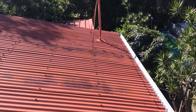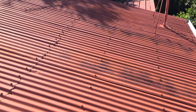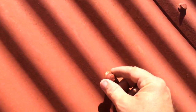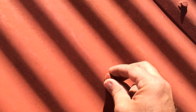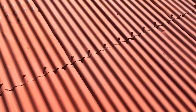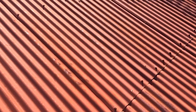I'm up on this iron roof today and it's got the old-fashioned lead head nails. The lead heads on them actually just come off sometimes — they're just sitting on there. Lead is pretty soft so sometimes they just work loose and come off. Lead head nails probably should be replaced; they're not legal anymore to use.